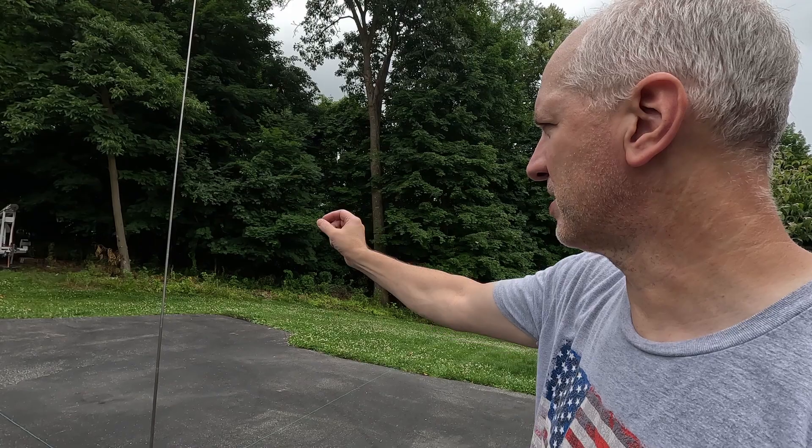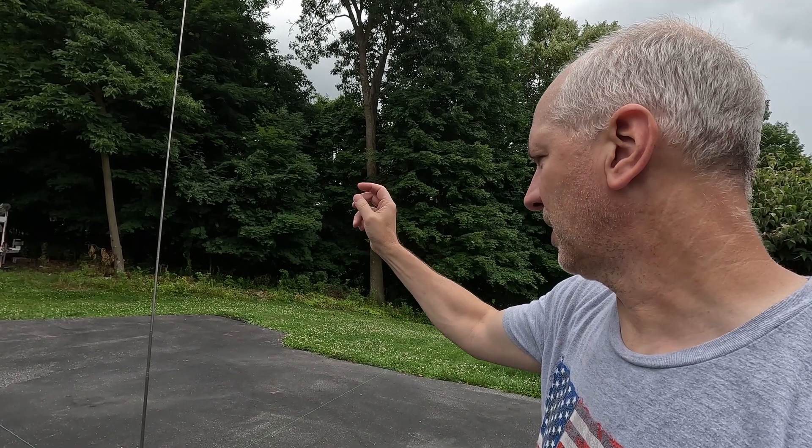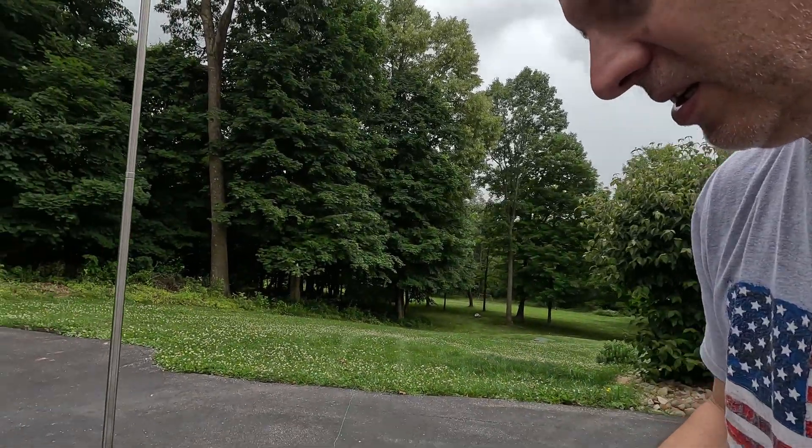It's their new whip which is double crimped and it collapses shorter. So I needed a way to stand it up — I was using a spike, but I wanted something better. I was looking at little mini tripods, but you can't just plug the antenna into the tripod. You have to have some type of adapter, and some of them have little nuts for attaching radiating wires. I didn't want to mess with anything that had screws or nuts.